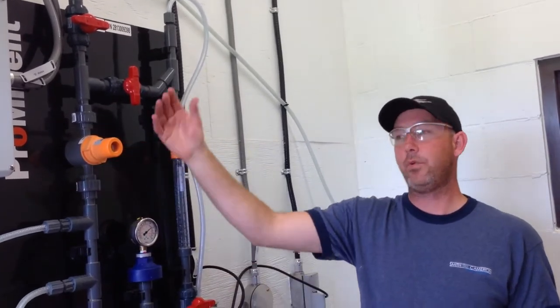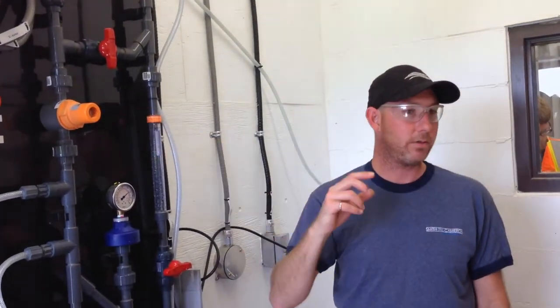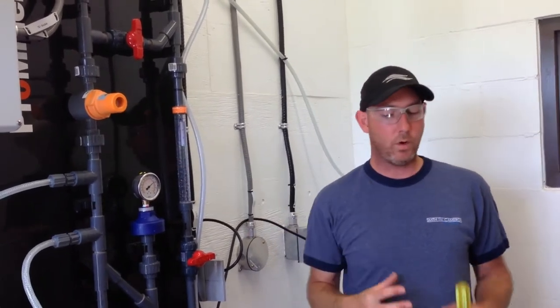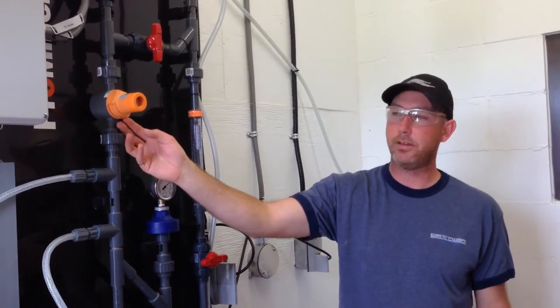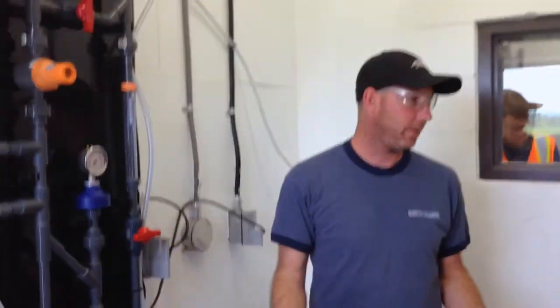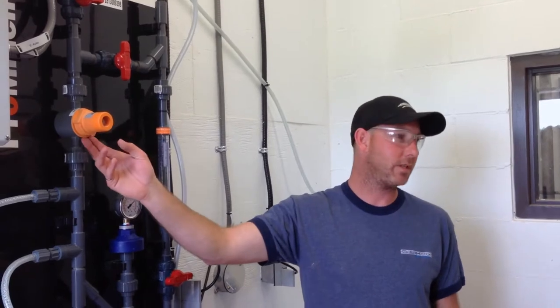So you depressurize the system, take this piece out, back this off right out so that there's no pressure on the spring, and then this unthreads from here. Once you take a diaphragm out, you shouldn't put that same one back in, because it'll pinch lines in it. If you do, there's a good chance it'll leak, probably out the side here. So if you're going to take it apart, have another diaphragm with you. If you have to, you can put it back in and squeeze it in tight, but be ready for a small leak if that happens.